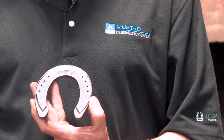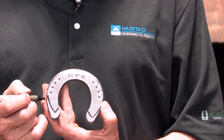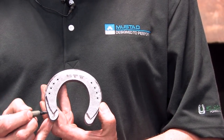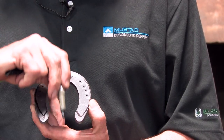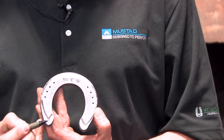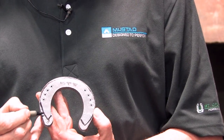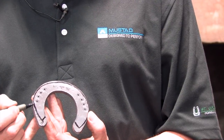Now I'm going to address the back half of these Double S reining plates. As you can see, I drew the buttress of the heels on each side. With my experience of shoeing reiners over 25 years, where horses step on these in the cross ties, the wash rack, or in their turnarounds is in this area right here. This area I always address over the horn before I apply these to the feet. They're open because the dirt needs to travel through the plate and out the back of the horseshoe. The center of the heel is right here, and what I want to do is forge the center of this heel over towards the inside so it meets up with the center of the buttress. Basically I'm going to forge this over the horn — push this where it kind of donkeys out, push it over to the inside. Then you can box this on your grinder or rasp it, and it will make a smooth transition from the wall or the buttress of this heel through the inside and then around the foot.